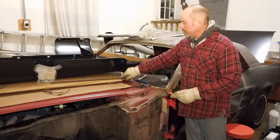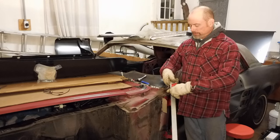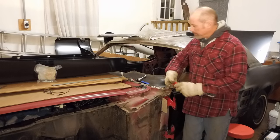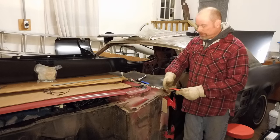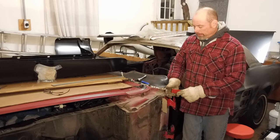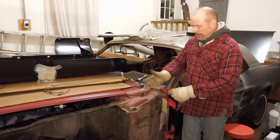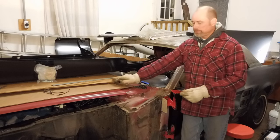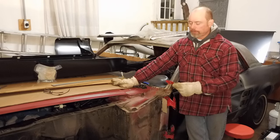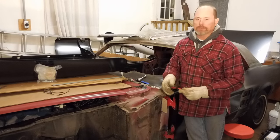It's about the same size as the one I took off on the passenger side. This 1/8 inch is a little bit thicker, but that's okay. The only issue with this bracket is it's not identical from side to side — it's a mirror image. So I have to make the bracket the reverse of the one that I have from the passenger side.